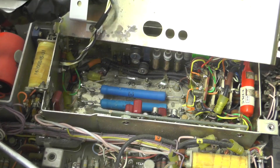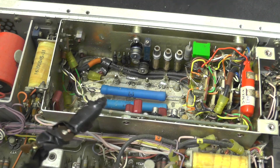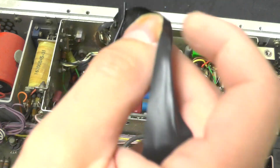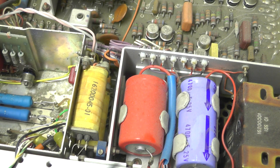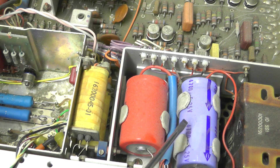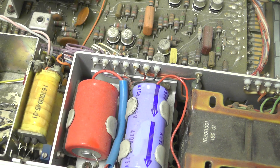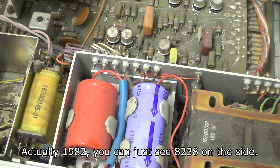There's something bodged on here — looks like some battery terminals, so I suspect there was a battery in here at some point. Looks like it's got some kind of holder for a battery or something, and those were the connections for them. Just looking at this power supply section on the other end, it looks like this cap has been replaced at some point. That looks like an RS branded one — I can just see a date code around the other side of 1983, so that original filter cap obviously went bad over time and somebody's replaced it at some point.